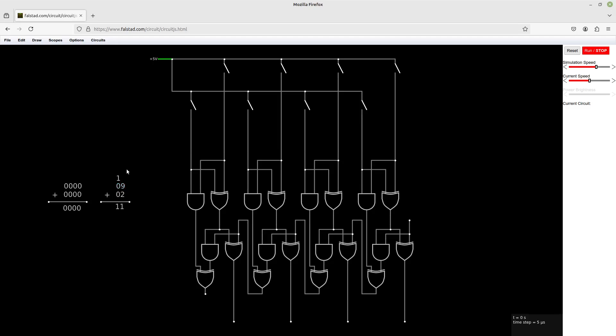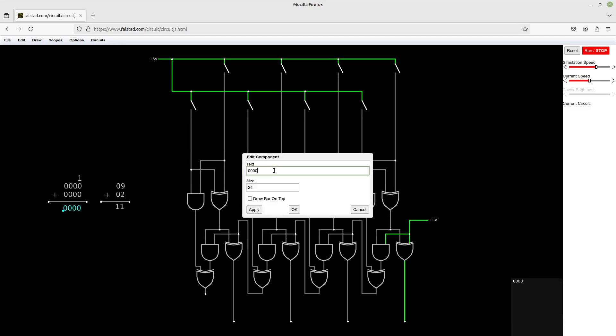In the process, we did this carry. Now, by having this here in our circuit, you can see this is the number 0 — all the switches are open. If we run this, we should get 0 coming out. And yes, we get 0 coming out. Now, if we apply voltage to this little spot in the circuit right here and we run it, you can see we get 1. The reason is because we are essentially adding a carry in — we are saying take these two numbers, add them together, and add in a 1, and that gives us a final result of 1.